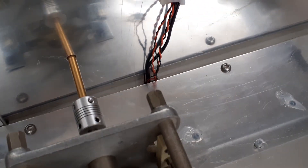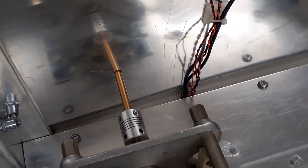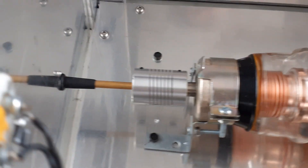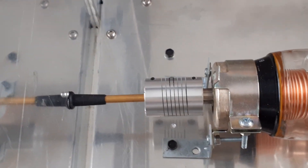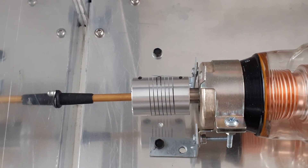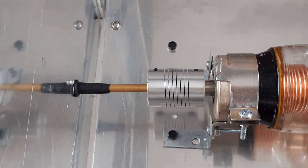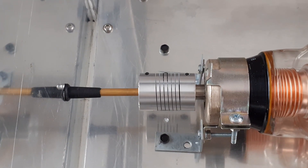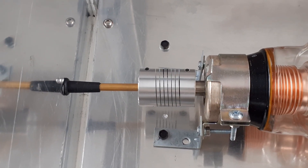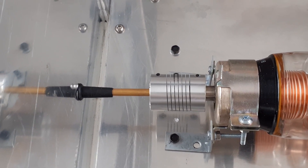This one here I think was quarter-inch to quarter-inch, or 6.35mm. This one has a 10 to 12mm shaft on the plate capacitor, so I needed to change it down to quarter-inch or 6mm brass rod. It works as an adapter as well as a coupler — it's got a kind of spring on it, so if it's slightly misaligned it takes that up.